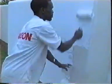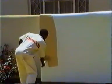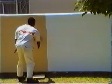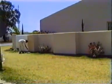When the last drop has been applied and the paint is fully dried, then proceed to the fifth step. Go back to the starting point and apply the final generous coat of paint to completely fill and cover the Crakgon fiber pattern.